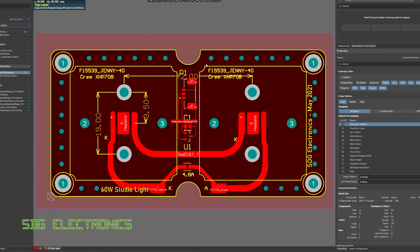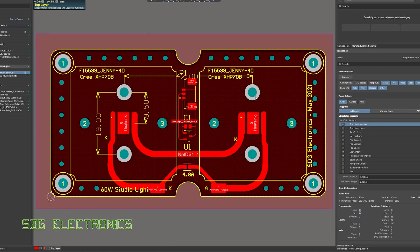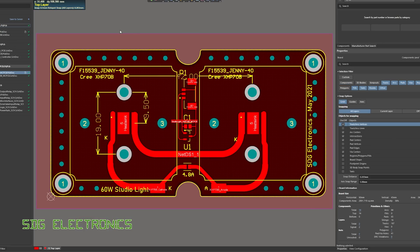Here is the new design in Altium Designer and I'll put a link in the description down below if you want to get hold of a free trial. There are just a few changes since last time. Here's the previous revision of the board which you're probably familiar with. On the new version, first of all, I've beefed up some of the traces. I neglected to do that previously and actually with 4.8 amps going through these traces we were wasting a bit of power, so those have been beefed up. I've also removed the bottom side of the PCB because the aluminium board is a single-sided board.